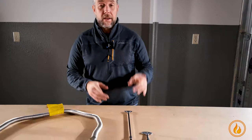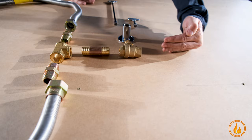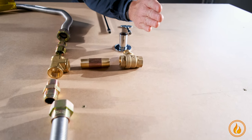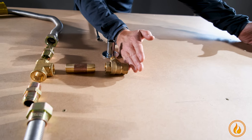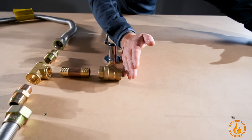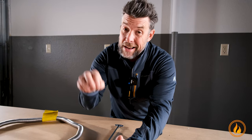In this video, I'm going to go over specifically our dual flex line kit. Here you go. The first thing you'll notice is missing is your fuel coming in, okay? Everything that happens from the key valve south to your fuel supply line is not provided in our kit. We call it everything from the key valve north to the burner is what we provide in the flex line